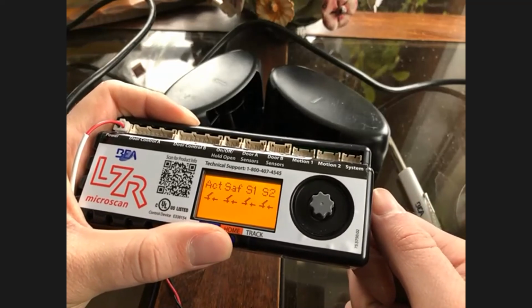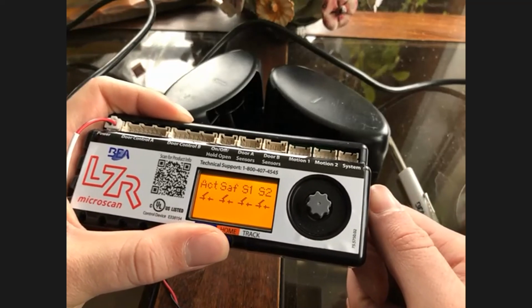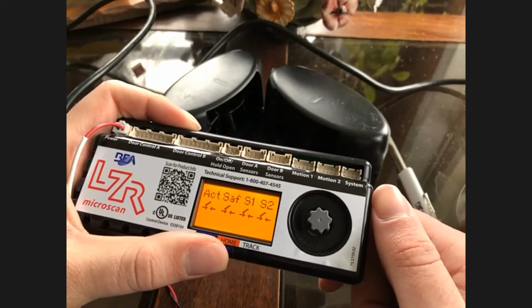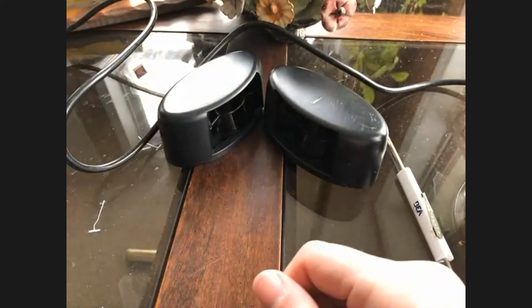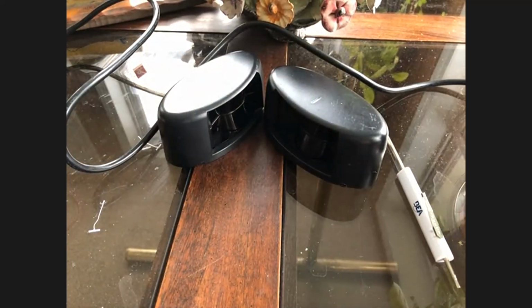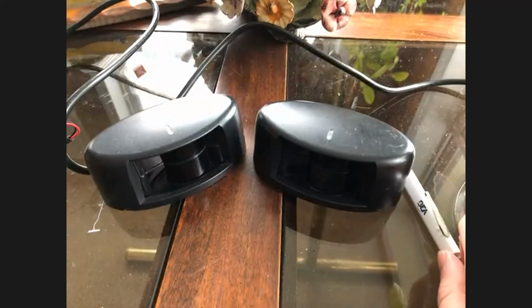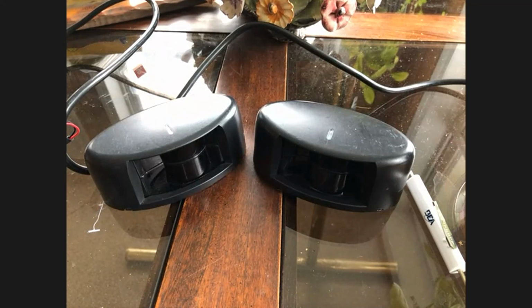Just to be clear, the reason you would subtract like so, and there are a lot of different types of doors: if you're working on a door that has a physical stop, the physical stop would be a half inch. So if you measure the physical door itself in the closed position, you'd subtract a half inch for that stop, and then you'd minus an inch, so you cannot see that stop. But if you have a storefront door, which is very common, you just subtract 1 inch to make sure you comply with the ANSI standards.